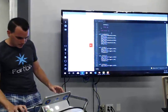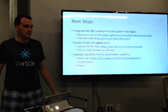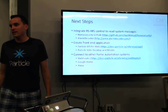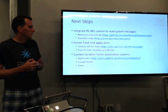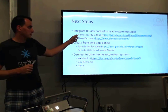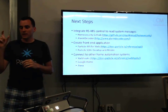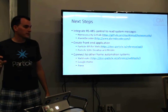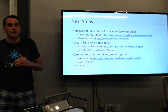For next steps: RS-485 is a really open standard, just serial. There's a home security GitHub project that reverse engineered enough for an Arduino to read the data, and other projects have built on that. There's at least one ESP8266 solution redeploying that package. There's also a company called Alarm Decoder who's done all the work and will sell you a module that can talk to an Ademco or DSC system via serial connection. If you really want to get fancy, they've got serial and USB options. Of course I should also make a proper front end with authorization and all that.